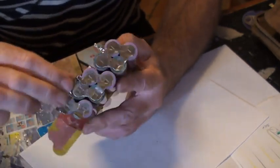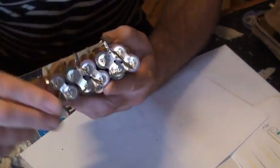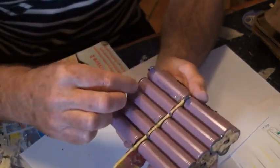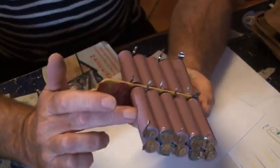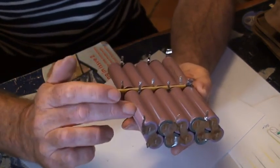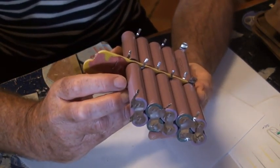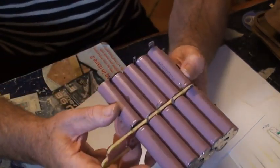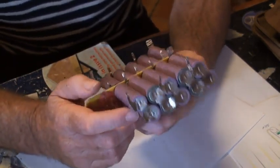Aha, which brings me on to another thing now. I say good. All these cells have had abuse of one sort or another, and I'm sorting out the terminals a little bit here because I've been bending them over. Right, so all these batteries remaining in this battery block now are showing 4 volts. Not only that, I haven't charged them at all in weeks, and they seem to be retaining their charge, which is a good thing. So I would expect to leave them a month and not to see any significant or even any voltage drop